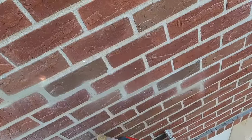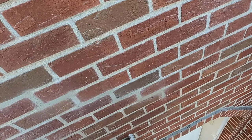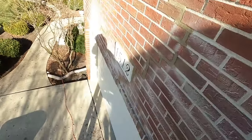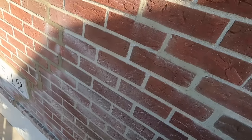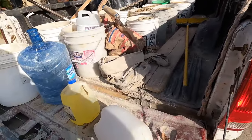I was talking to the customer and basically telling him that the more meat — more mortar thickness — I can put onto this wall is going to be a lot better. What I mean is, we're going with a flat joint instead of a concave struck joint. The mason before me who did some tuck pointing work on this crack just went with a flat joint. I think it's smarter — you get a little more thickness of new mortar. If you strike it concave, you end up with less thickness of new mortar going in there.